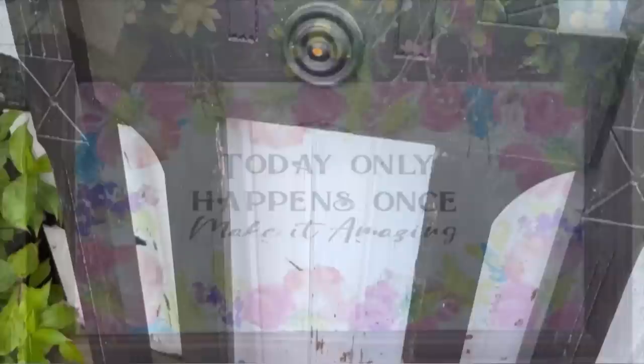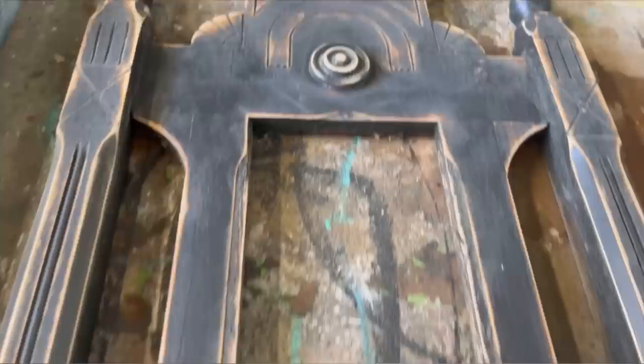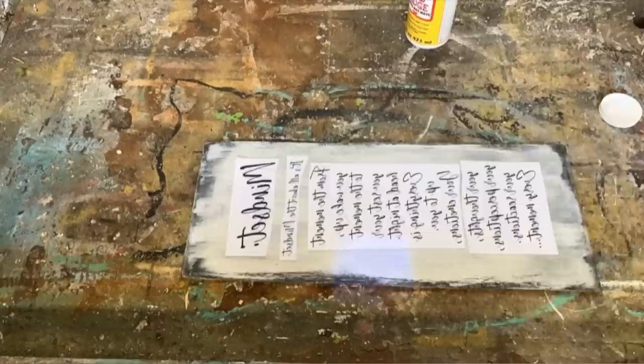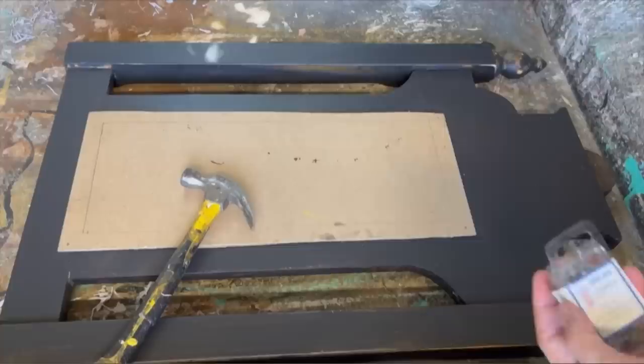I found a piece of an old broken chair in the wood pile at the dump and brought it home — I'm going to turn it into a fantastic wooden sign. It was already painted black, so I'm just sanding it down and distressing it, then going in and adding some wax over that whole back of the chair. I had a piece of scrap wood that I cut for the back to fit in the middle — painting it with some black chalk paint and then some white chalk paint, putting a little bit of candle wax on too to give it a distressed look. It's going to fit right in the back of that chair. We're going to do our Mod Podge reverse graphic transfer method with this quote — putting the Mod Podge on graphics printed on my laserjet printer, letting it sit for 24 hours, then taking some water to rub off the paper, leaving a beautiful graphic. Sealing everything up with some polyacrylic sealer and nailing it onto the back of that chair. This is what I created from an old piece of a chair from the dump.